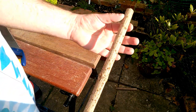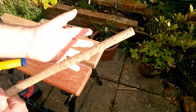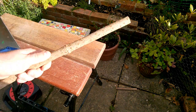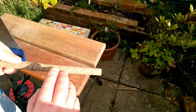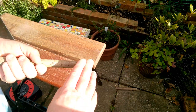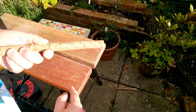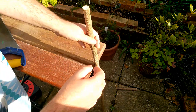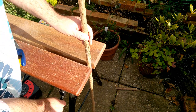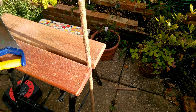I'm not going to cut my piece of wood completely off because it's going to be much easier to hold on to and work with if I keep it long. So I'm actually going to leave it right on the end of the stick. When I'm working to peel the bark and shave it down, I'm going to keep it in one piece and then cut it off later when we're happy we've got the outside done. So let's get that fixed in the vise loosely, and then we're going to drill out this end.